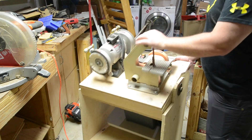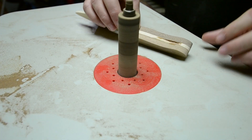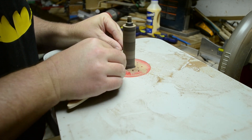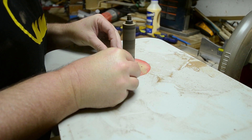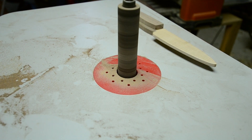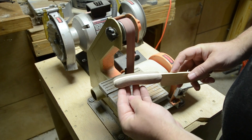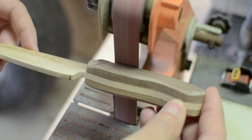This is the flip-top cart from Drew Fisher at Fisher's Shop — I will put a link to his build video and plans in the upper right-hand corner. I used the mighty Craftsman oscillating spindle sander to further refine the inside of the handle. When I was done with that, I went back to the one-inch belt sander, and you can see that I am sanding above the platen so that the belt will give the handle a more rounded-off look instead of hard, flat edges.